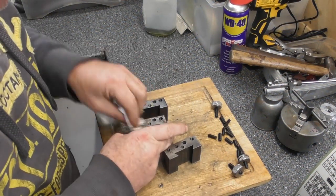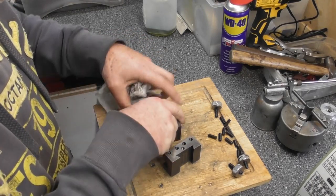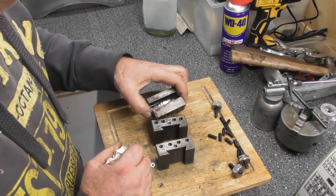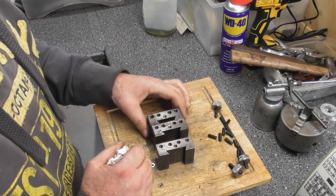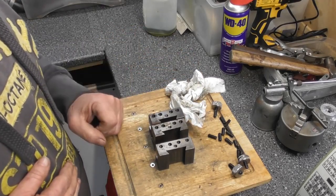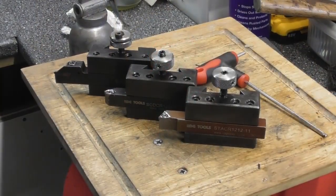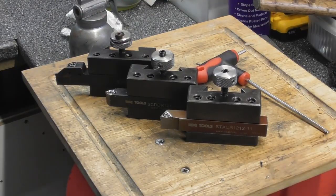I mentioned in my previous video about the state of these tool holders. As you can see they're getting a bit rusty. The one I use most often isn't too bad because it gets a whizz in oil, but the ones I use more rarely have gone rusty. They haven't done too badly with the chemical blacking — they've probably lasted 12 months and they're just starting to go now. So I think the wire wheel on the little grinder will be the boy for that, just to give them a quick clean over. That's the three tools reassembled — I just need to set the centre heights back up. No rust — happy days.